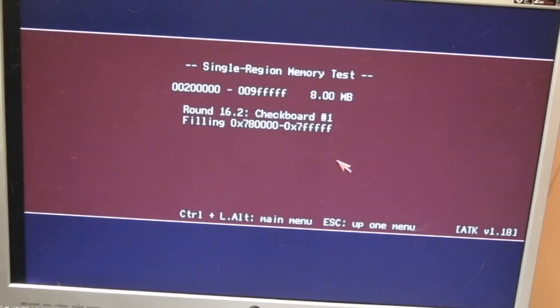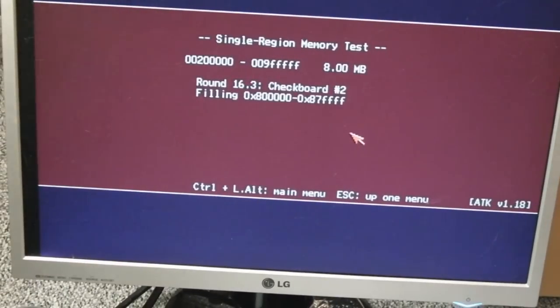And then test the serial and parallel ports and then just test it for a period of time, do the tap test and stuff, because I'll guarantee if I tap this with a screwdriver now, it'll probably crash, because I think I've got a bad connection somewhere. Let's just try it, let's just do the tap test. Well, it's still there, so I honestly don't know how stable it's going to be. Anyway, we'll do some burn-in testing on it.